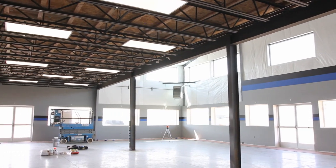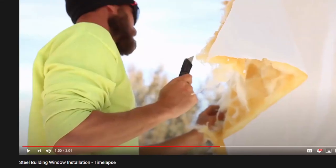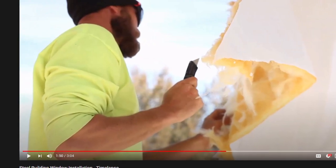On lightly insulated walls, our windows will come with insulation hold fins with the kit, but they only work with insulation up to six inches thick. If you watch our insulation video from last month, you'll remember that we don't recommend six-inch insulation on the walls because of oil canning, but the windows will work with it.